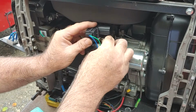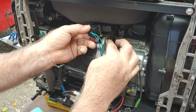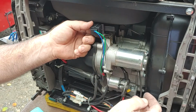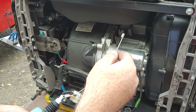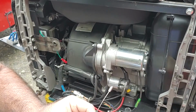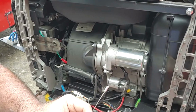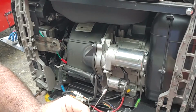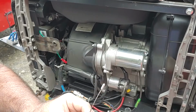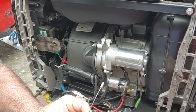Short end to the right. There we go. That's a smart feller. Alright, so that's how that's going to go. But we got to run the cable in. Let's see. Actuator cable. Generator choke to the right of the middle brace. Got it. It's on the other side. Unhook the spring. Feed the choke cable in the gap between the motor and the gas tank to the right side of the fuel line.